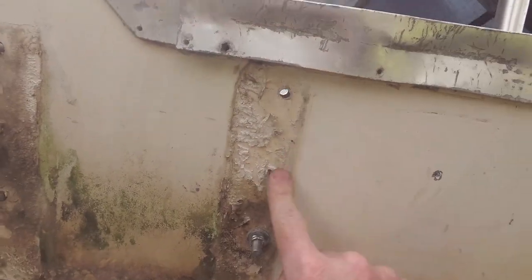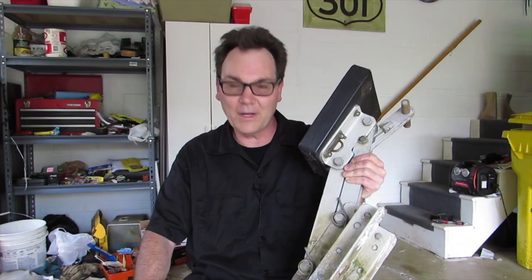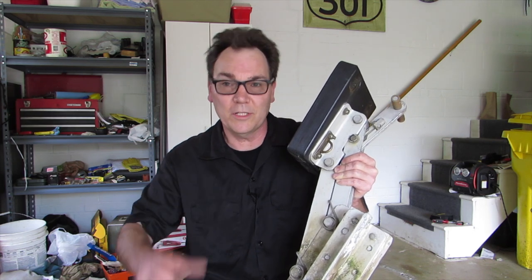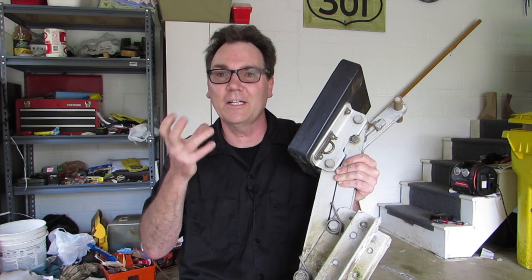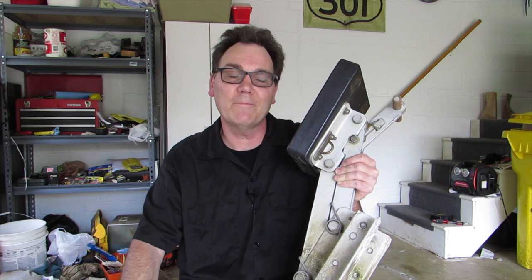So what should we do — fill that in with some fiberglass? Grind it and glass it? This area is all beat up too, so maybe we're fixing that as well. Got the weight off the back of the boat, but now I've got four holes where this mounted that I need to plug up — they go through my transom. There are a lot of different options. One is putting the bolts and nuts back through and just sealing around them — that's the easiest and quickest way. Another way would be to grind them down, fiberglass or resin them, then sand smooth and paint to fix it all up. I may do that — it might be kind of fun.